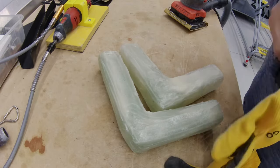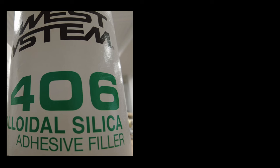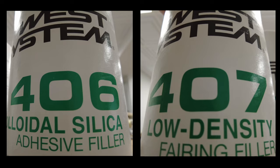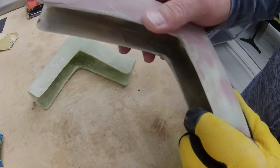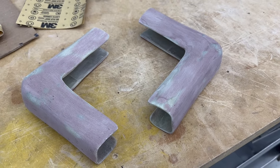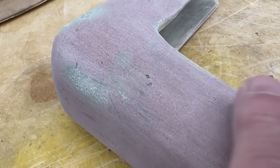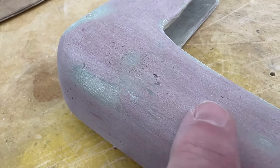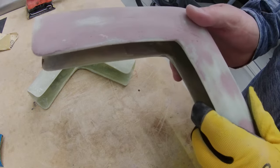Once you've got your layers done, it's time to begin the finishing process. You've got to fill in the weave of the fiberglass cloth with some sort of thickened epoxy. I like to start with colloidal silica mixed with epoxy resin, then later switch to some sort of low-density fairing compound. I used a low-density filler with the epoxy resin to smooth out the weave, but I'm just not happy with the results — it's not quite smooth enough. This is sometimes an issue when you need an epoxy fairing compound that is easier to spread, smooths a little better, and sands down a little better. You can see the little pinholes and imperfections in the surface, and it's got to be better than this before we get to the point of putting on paint.